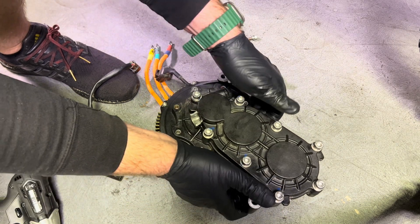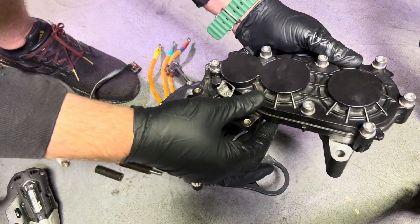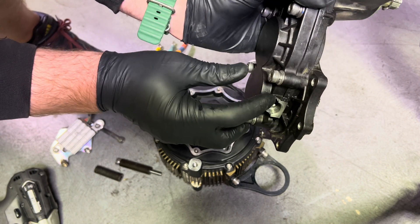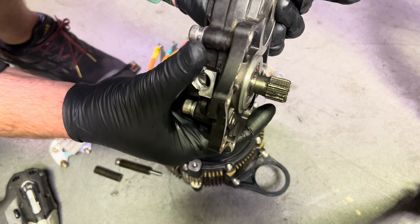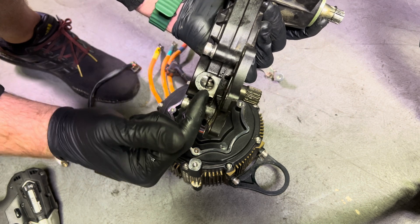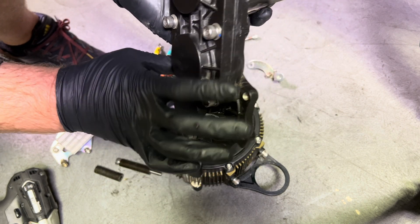Your gearbox may need a little bit of tapping to pull out, or it may just come out. You can see right here — this whole drain plug housing just cracked and this does need to be replaced. You can split this gearbox in half and replace just the half with the drain bolt on it, but today we're just going to be swapping the whole gearbox.